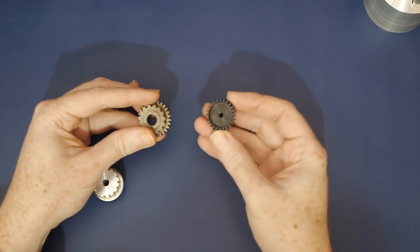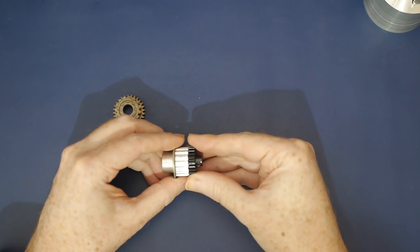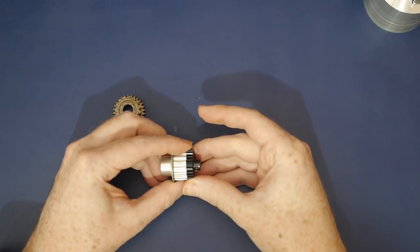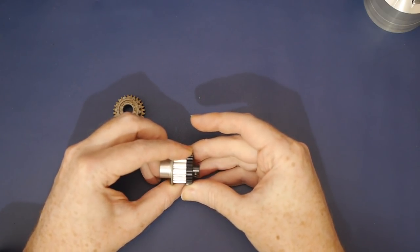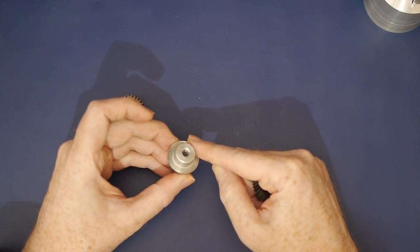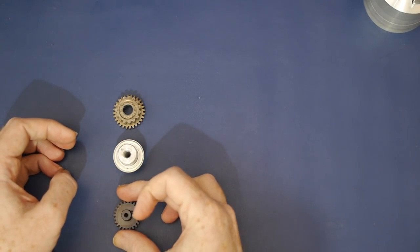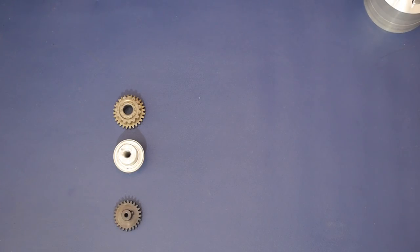It's more than thick enough, but it has this hole on one side which I'll have to take account of when I'm working out how to attach the two together. Both will need to be reduced in thickness and have the spigots and other features removed. To start with, however, the spigots on both parts will be useful for work holding. A gear bodged together from such different materials isn't ideal, but better than nothing.